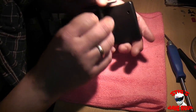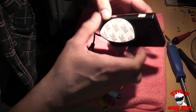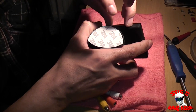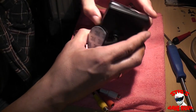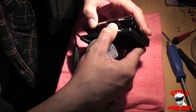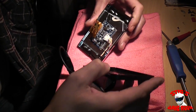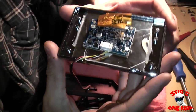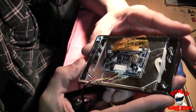There are two screws just on the back of this here. The two screws are now removed so hopefully this will pop open. There's a little security sticker here — I'm not going to be trying to get my money back on this one. Hopefully it just pops open. I don't want to rip any ribbon cables or anything here. Okay, came apart lovely.